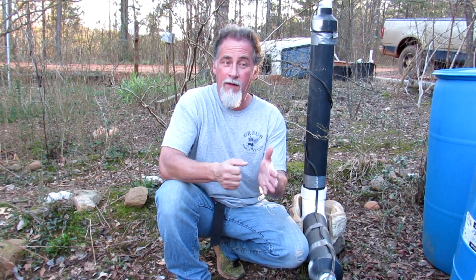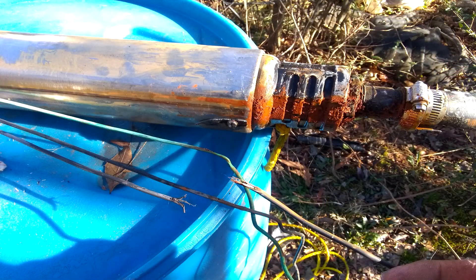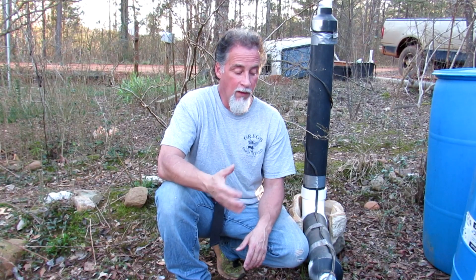I had to pull my well pump, and it turned out that from moving back and forth against the rock down there — probably granite — it had been scrubbing against the casing and finally rubbed a raw spot in the wire. Every time the pump kicked on, it would short out down there. But I still had wire left, so I found the problem and fixed it.